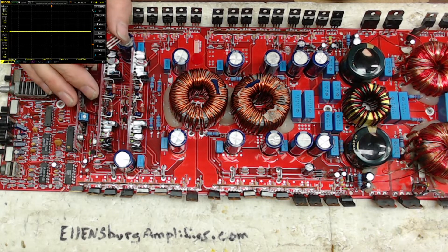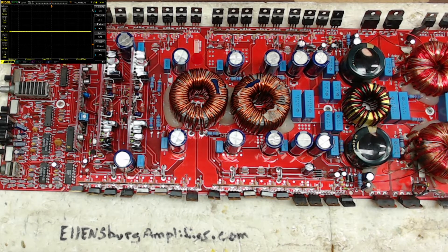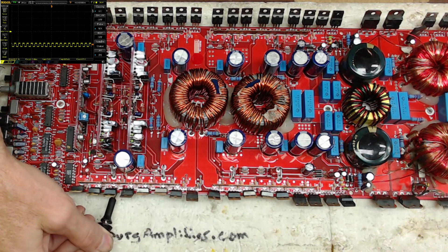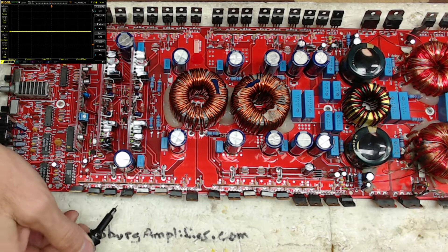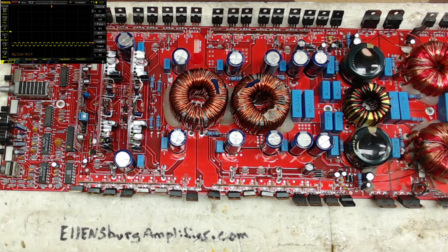I do believe it has something to do with the gate voltage. I haven't gone deep into the specifics yet, but let me fire this board up and show you on the scope. You can see here it looks to be about a 12-volt peak-to-peak drive on the scope — it seems to be using a pretty high gate voltage. So it looks like about a 12-volt gate drive, which makes sense why the 31/20Ds that require that slightly higher gate voltage show up as a diode between 2 and 3.